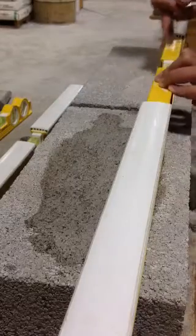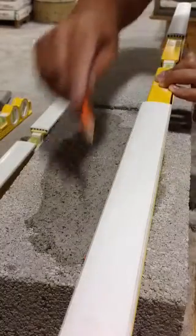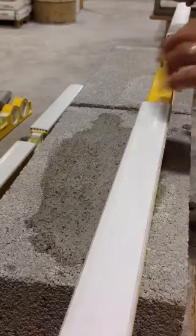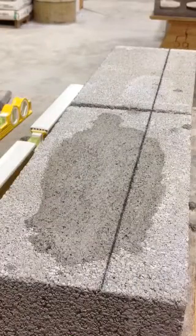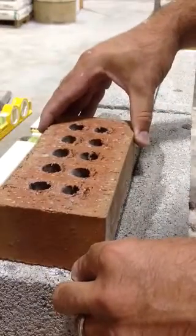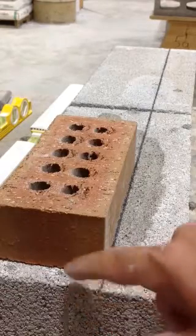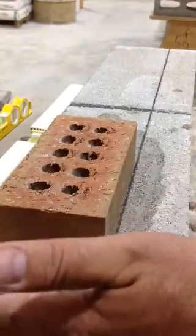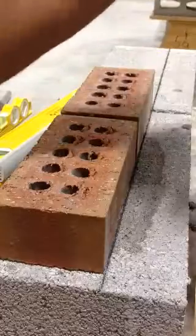So the first thing you've got to do, you want to lay out the front edge of the bricks. You guys are going to have more room, because I'm just doing this on two blocks, so there is going to be a little overhang — I just can't fit it all on this table. So I take my 4-foot level and mark a nice line. Then you take your bricks — this is what we call dry lay — and please make sure that you're at least about an inch away from the edge of the block. Make sure you stay away from your neighbor too, because you're going to have to find a way to stick your level in there with your partner. So right now, just dry lay — just lay the bricks down.